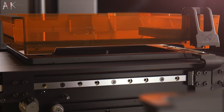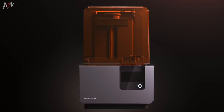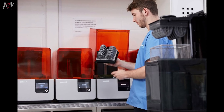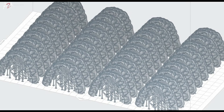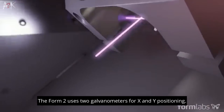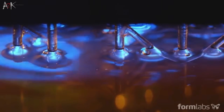It's been proven over time that the precision optics engine built into the Form 2 meets the accuracy requirements for the most challenging applications, such as when utilised in dental labs, who on a regular basis must produce numerous amounts of highly accurate parts. Two galvanometers for the X and Y positioning are utilised by the Form 2. These direct laser light from the back of the machine to a large fixed mirror that reflects the beam to the print plane.